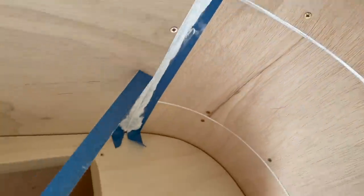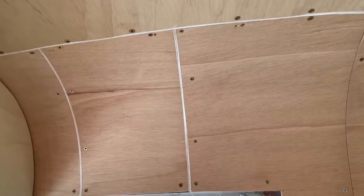Why do I use masking tape? Well, basically because I'm a messy one, and second of all with these gaps, what I found is if I use masking tape I can caress the sealant into the gap with my finger without making a mess. At the moment it looks like a mess but once I peel it off I have a nice fine line as you can see on the screen. That's why I use masking tape.